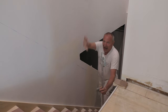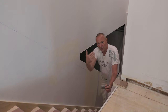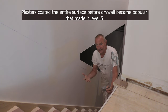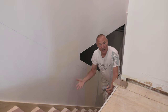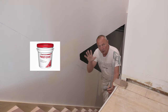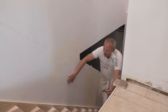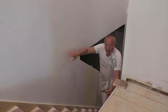We used to check it before we hung the drywall, cut the studs and straighten them out before we even hung the drywall to prevent that. But flat wall was different. Level 5 finish means you have the same texture everywhere across the wall, and they're actually trying to get the painters to do that. It's paint, guys. Most Level 5 finishing can just be primed with a USG first coat, or they have Level 5 primers to give it all the same texture — meeting plaster to drywall and everything else.